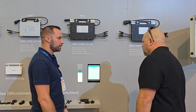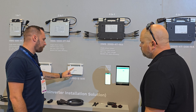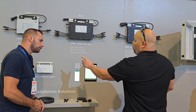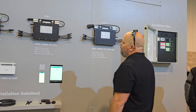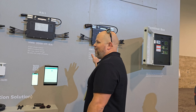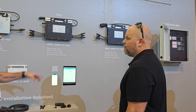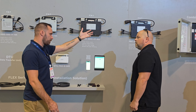What is the warranty on your microinverters? 25 years. And I think it's three years on the DTUs. So we don't need the DTU if we're using the combiner box? Correct. I'm a big fan of the combiner box — it's a centralized location where everything comes together. It has a DTU and meter built in, so you can do all your consumption monitoring with the combiner box.